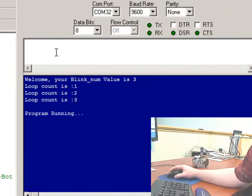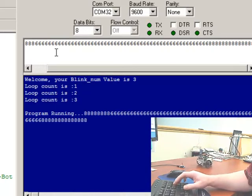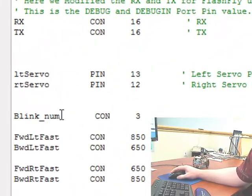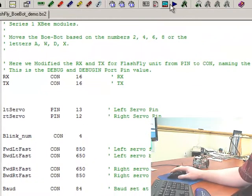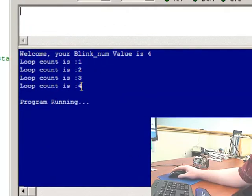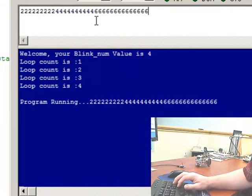What I've got running lets me control the Bobot using my keypad — it's on the desk so I have to be a little careful, but I can control it. I've also got a little LED in there, and I want to show you something. In my program I've got a variable called Blink Number. Let's change that to 4 and hit program. It's wirelessly downloading to the Basic Stamp — and you should see that light blink 4 times: 1, 2, 3, 4. It changes really easily. I can still control it and do anything I want.